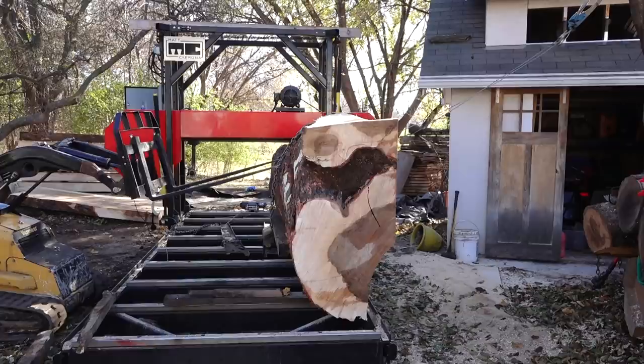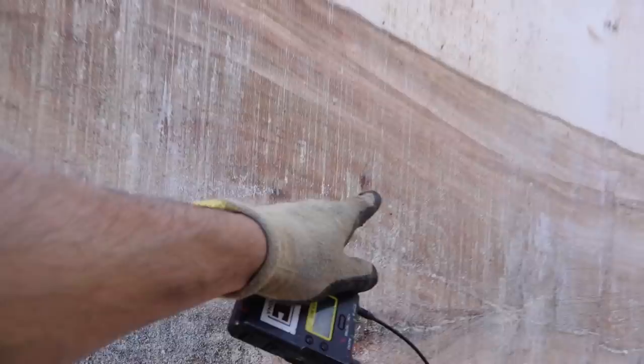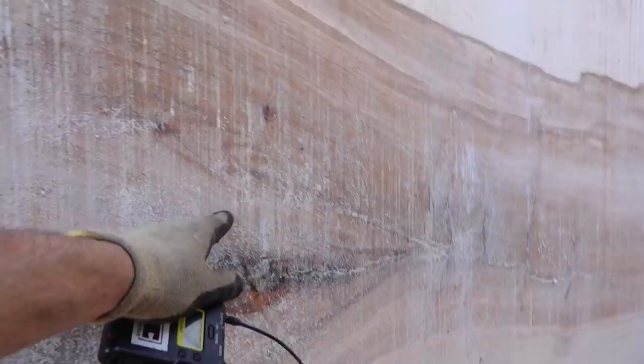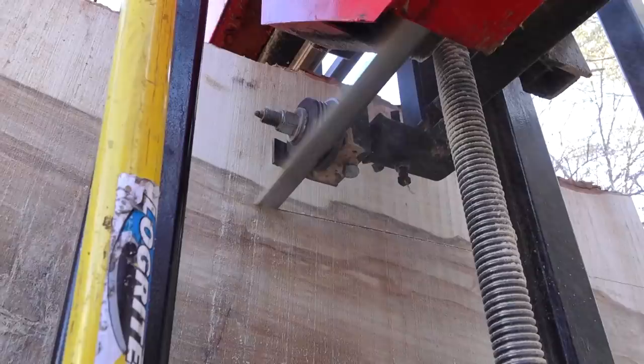So this thing is still incredibly big and heavy. So with it standing vertical like this, I'm just gonna come in and make a wasting cut and just remove a bunch of this material, make it a lot lighter. The actual bench top is somewhere down in here, but we'll come through here with the blade and take this whole top part off of here. That'll make it a little more maneuverable so that we can actually get the bench top we want out of this section.